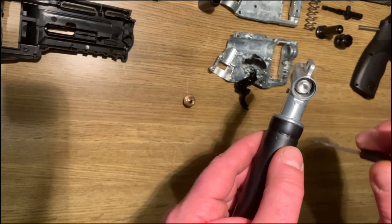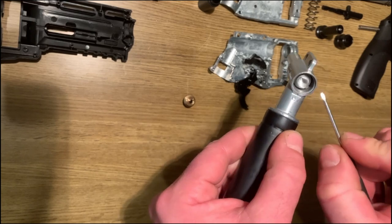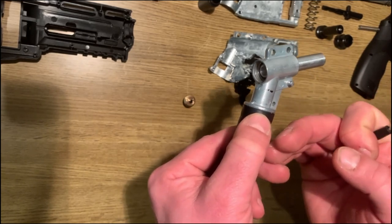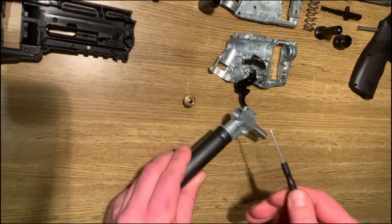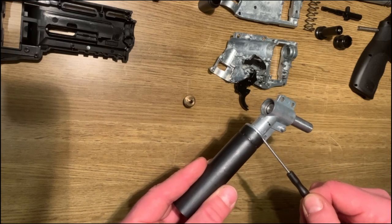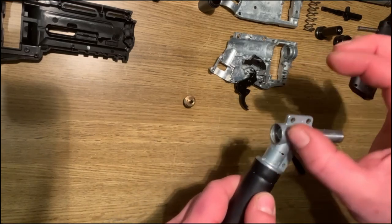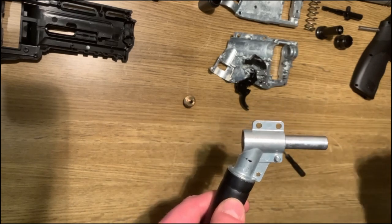This part causes the chamber space to be smaller. And this part causes the incoming air to be smaller. And what we're going to do now, we're going to remove the block. And since it's the 7.5 Joule version, there's no valve in there either. And when we've removed the block, we kind of have an open part here. The open part is constructed the same as the open part of the 11 Joule version.